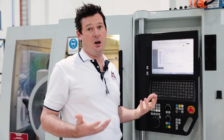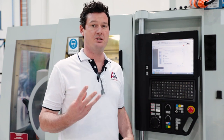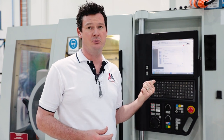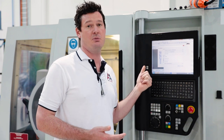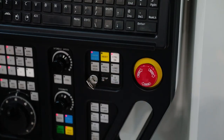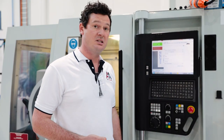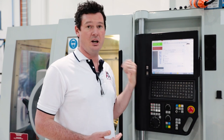The iGrind window has popped up, so the machine's ready to go. To enable the machine, it's a three-step process: I pull out the e-stop button, reset any errors using the error reset button, and then I enable the machine. People often ask why you need the e-stop, error reset, and machine enable. The reason is simple — e-stop closes the e-stop chain, error reset resets any errors, and machine enable starts the CNC servo system. You can hear that it's running now and it's ready to proceed.